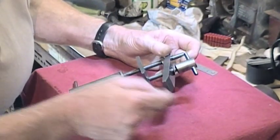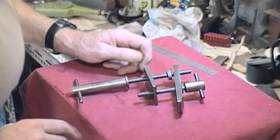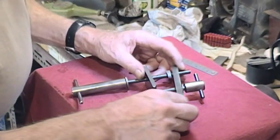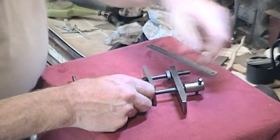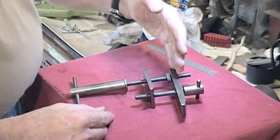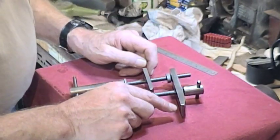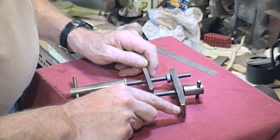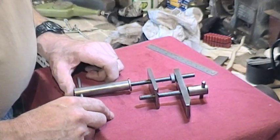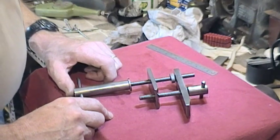The relief on the front of each of the bottom plate and the top jaw — I think partly it's for aesthetic reasons, not much else. For the angle, if we're gripping a piece we would generally have the top jaw slightly high at the rear so the main pressure comes on the front. Otherwise, that's about all there is to it.